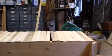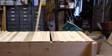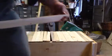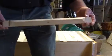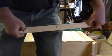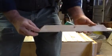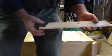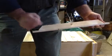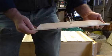Hi there. I saw somebody ask on a Facebook group about how to make top bar hive bars. I'm new at this and this is my first hive that I'm making. This is sized for 15 inches within the hive body with a one and a quarter inch ear on each side, three eighths of an inch thick and a 45 degree cut, and this is how I make them.